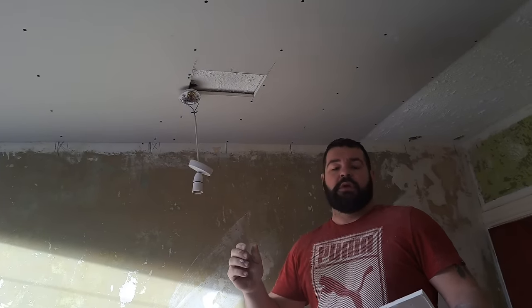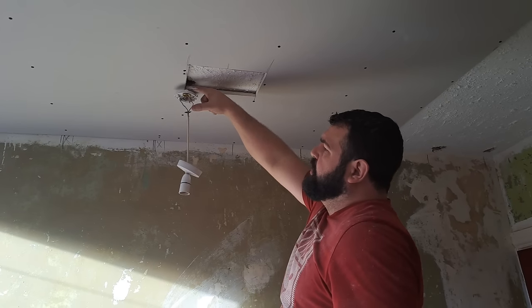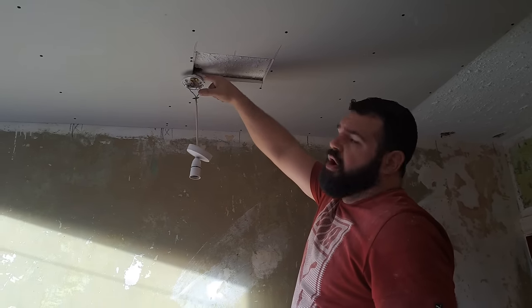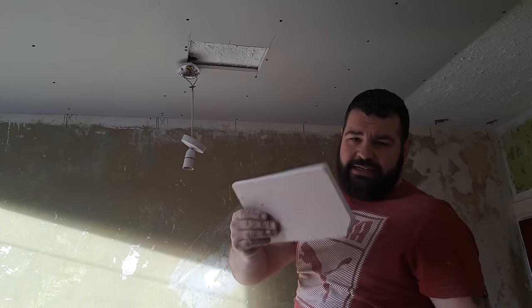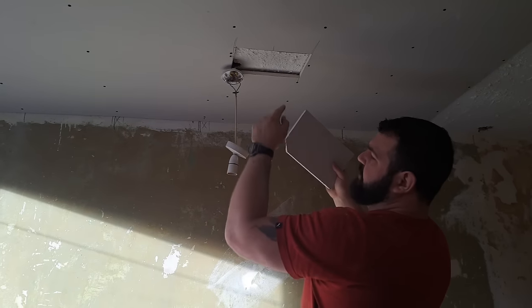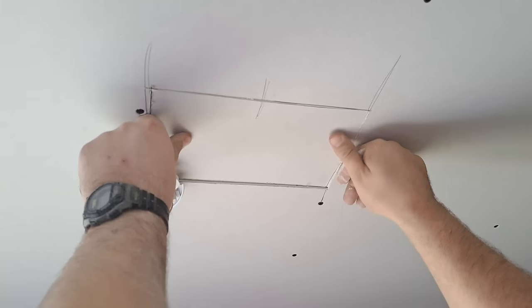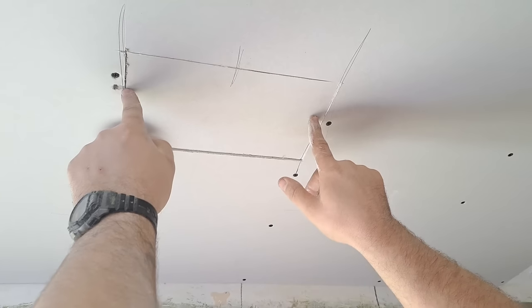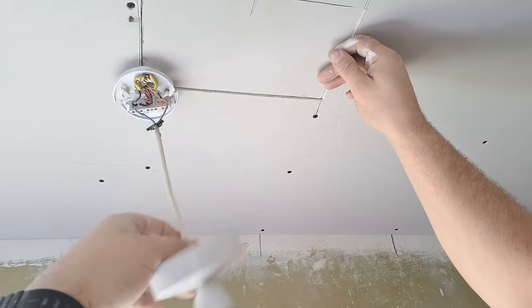The board's up. Remember you've cut that little square hole — you know exactly where the light is. You measured it to the nearest two joists, made a nice decent-sized square so you've got a piece to work with. Cut the corner off the square piece to make way for the cables. That piece just slots back in, screws up to the joist either side of it, and that is how you avoid having to take the light fitting down.